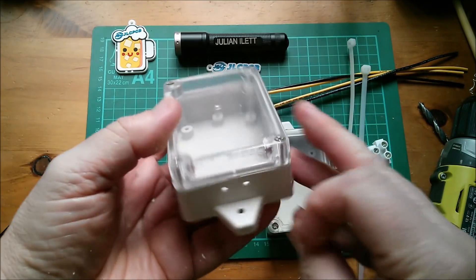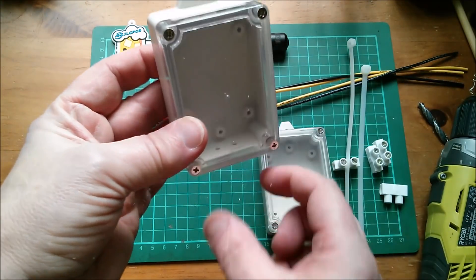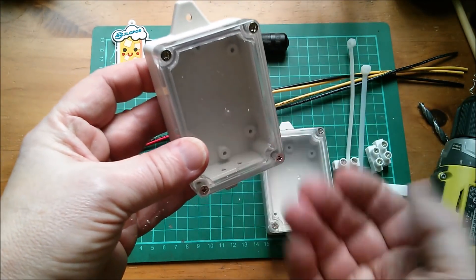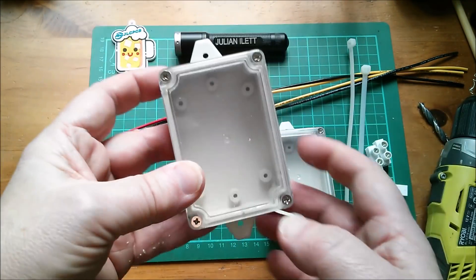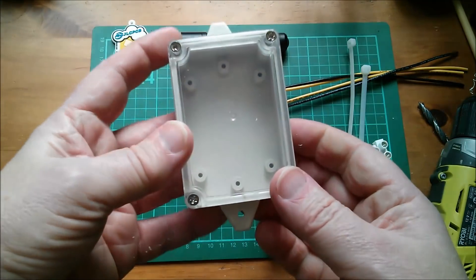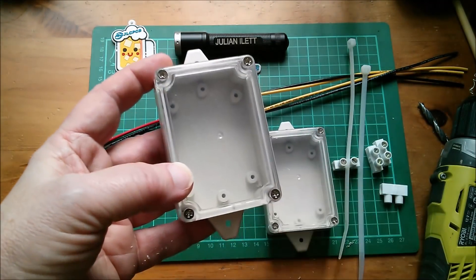These aren't a tight fit around the wires — they're a loose fit. The point with these enclosures is that they effectively breathe through these holes. When they warm up they push air out, and therefore when they cool down they'll suck in through the holes. But because no moisture can sit below them, they won't suck anything in — the warming up and cooling down will always act to pump any water out. There will be high humidity inside and a film of moisture behind the front cover.